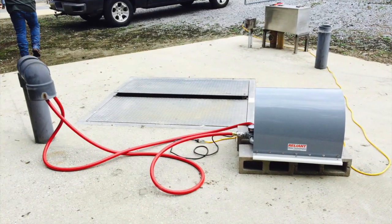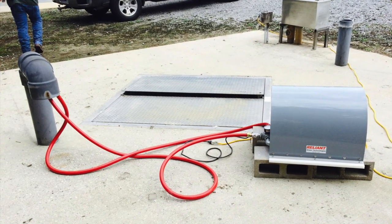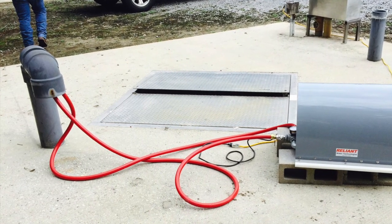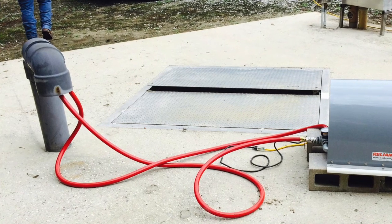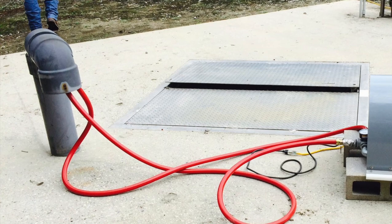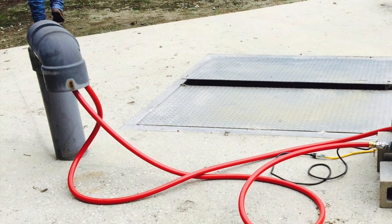Finding a way into the wet well may become the most time-consuming issue. Most lift stations have a large diameter conduit within which to run the hose, but if not, there are other entries that can be used. Here we have inserted the hose through the lift station vents. Pull the hose or hoses through the lift station door and connect the wizard to the hose using the cam lock fittings.